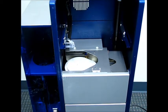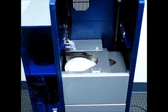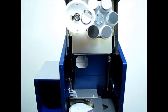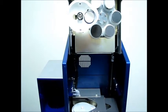So now that you've removed the upper splash cover, your plating table, your undersplash cover, and that funnel, take them all over to the sink, scrub them up under warm water. That's all you need. Dry them off before you reinstall everything. You'll have more room to get your hands in there and wipe up any other little splatters or leaks, and then reinstall, and that's part of your deeper cleaning. Now, deeper cleaning should be done once a week, or at the latest every 2 weeks. Again, the deeper cleaning takes about 10 minutes.